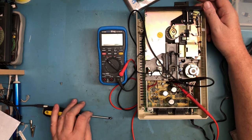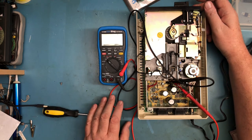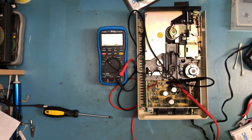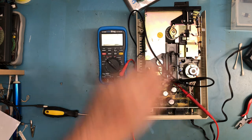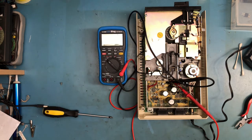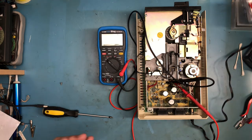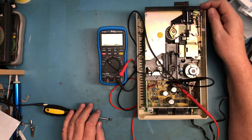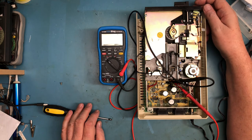The way he described this is, if you apply power too soon as that voltage is rolling off, the regulator will say, hey, wait, I'm not going to power up and run in this condition, because my input doesn't like that condition necessarily and won't start regulating correctly. It'll just shut off. I'm not necessarily seeing that behavior here.